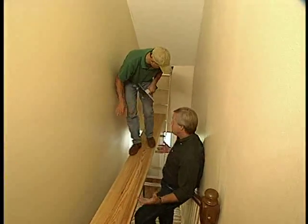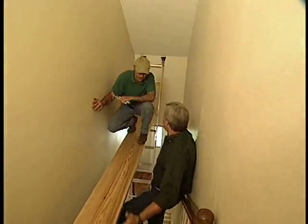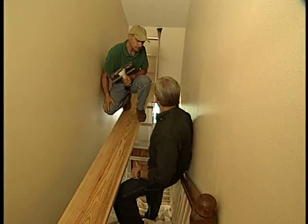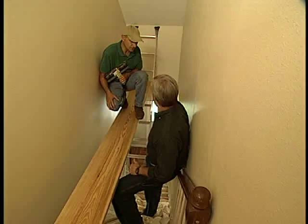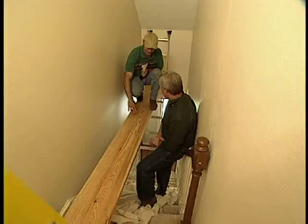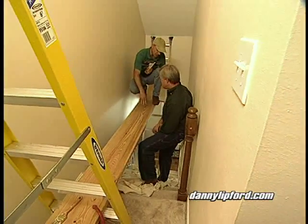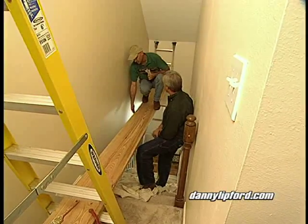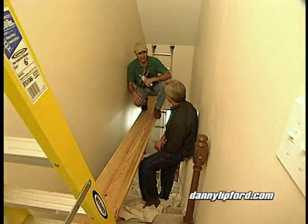This is a fairly typical stairway, but I've seen some that are really long and large, and you may have to put that actual ladder well away from where you're actually painting. Here we have about eight feet, which is plenty — this is sturdy enough for one person to walk on. Anything beyond eight feet, I'd support it with a vertical brace: just stand a two-by-four underneath and bring it right down off the stairs.